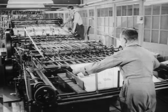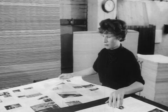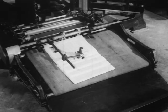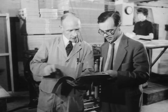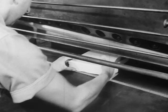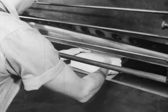An average issue has some forty pages, and eight pages at a time are printed on one large sheet of paper. The printed sheets are transferred to the folding machine. The single sheet, as it comes off the press, is a seeming jumble of pages, some one way up and some the other. But there's a method in it, and it all comes right in the folding. The folded sheets and the cover are assembled and bound together in a stapling machine. The edges of the folds are cut away, leaving the pages free for turning. The job is done — a new issue of 9,000 copies is ready for distribution to the Babcock community throughout the world.